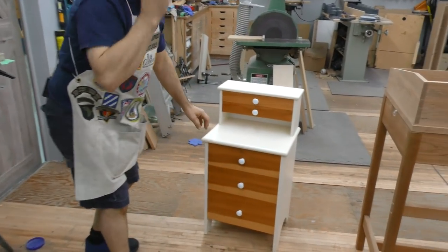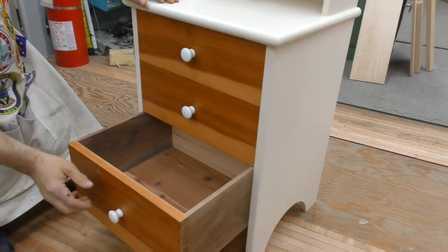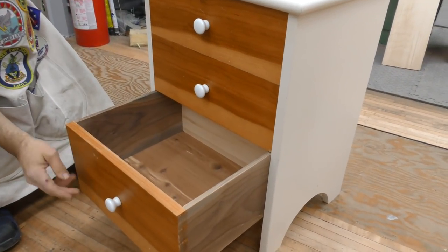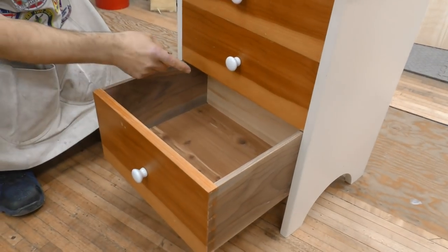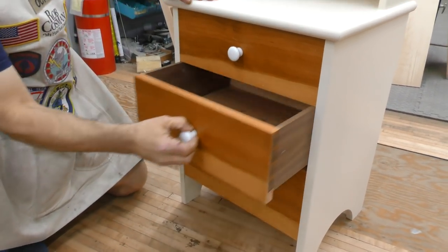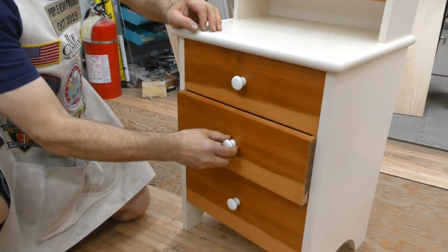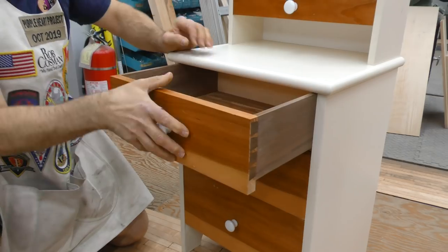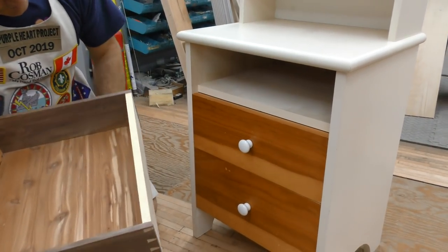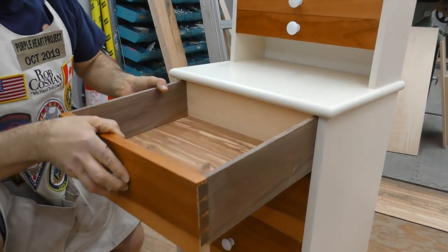Here's another — this is actually one of the projects that we used to build in the drawer making workshop. This one's made out of walnut with cedar drawer bottoms, pine on the front, aspen on the back — lots of different woods. Same idea: open it up and be able to close it from pushing in on one corner, and you can feel the cushion of air. Just a properly made carcass with a box that fits in there the way it should.